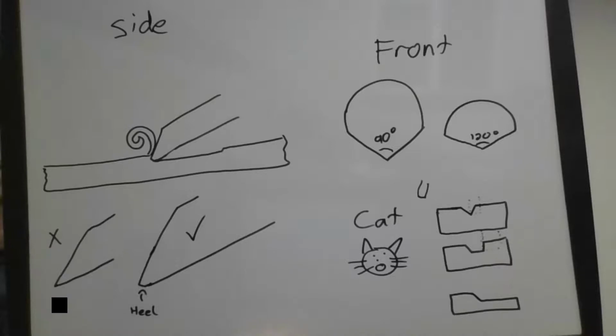If you had a little point like this, it would just dig into the metal and that's all that would happen. What it has on it is this little flat spot on the bottom of it. So while it digs into the metal, like here, it rides along this flat part called a heel, and it creates these little curlicues. And that's what allows it to glide through the metal and create these little V-shaped grooves, like you see right here.